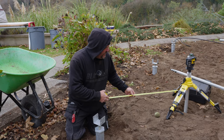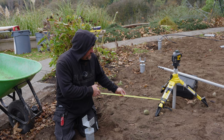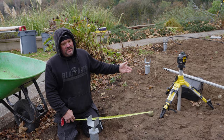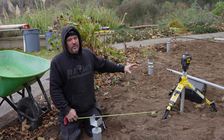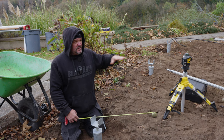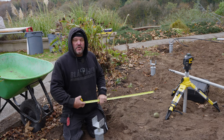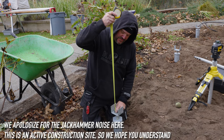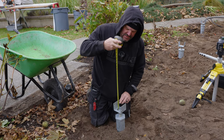I had to take apart our tripod and dig a little hole for this extension pole. I normally try to set the laser on top of a bucket or some old footings, but this is a more accurate way of creating the line I need. We've been using it all morning this way and it hasn't moved — nobody's knocked it over and it's very accurate. So now I take my tape measure, put it on the top of this pile, and we need 17 and a half — and you can see we're right there at 17 and a half inches.